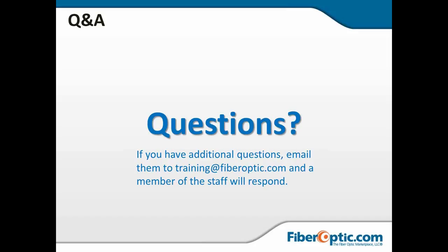Another question that came in by email, this person asks, I've heard people talking about PM splicers, and I didn't mention it. So what are PM splicers? Let's see. The PM splicers are polarization maintaining, they can work with some of the larger fibers. There's some, I think Panda Fiber is one of the brands. It has some built-in strength members, and it needs that special polarization maintaining fusion splicer. These are typically used only in a benchtop indoor environment, laboratory, and that sort of thing. So I hope that answers that question.